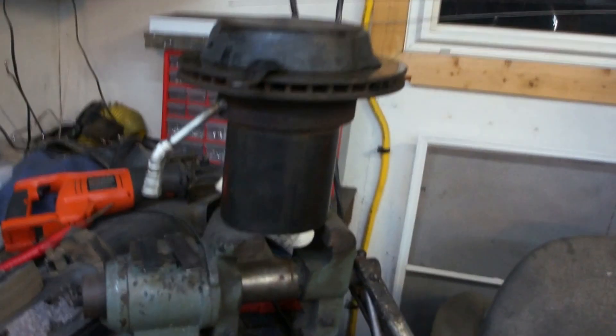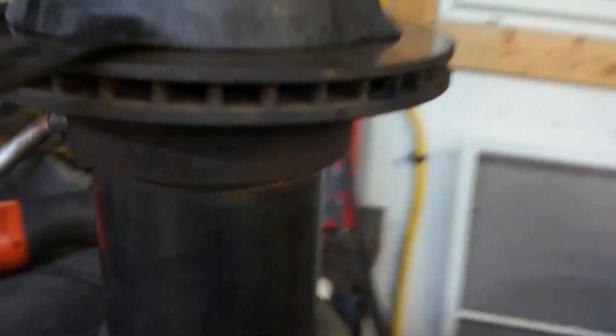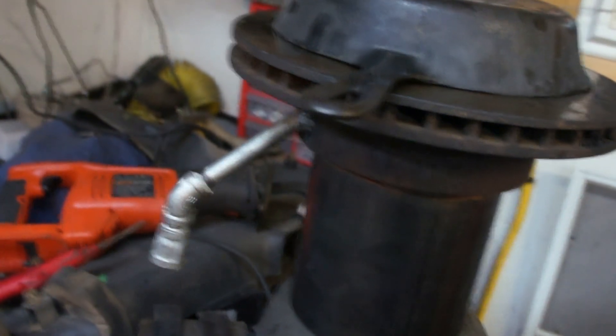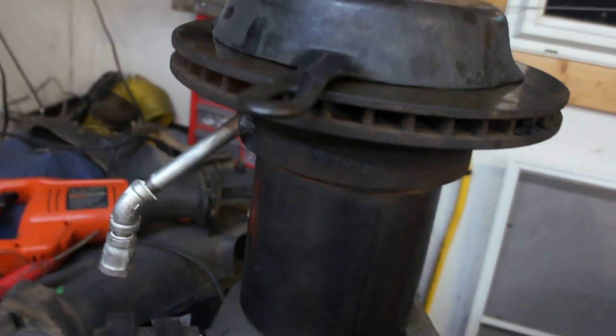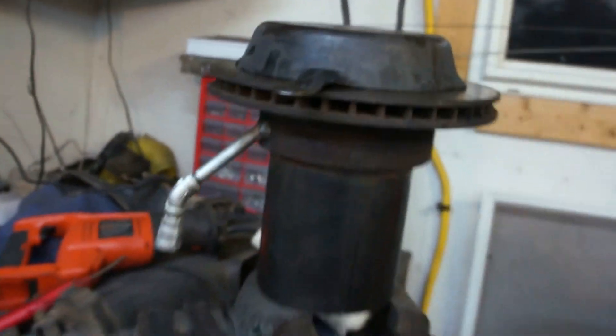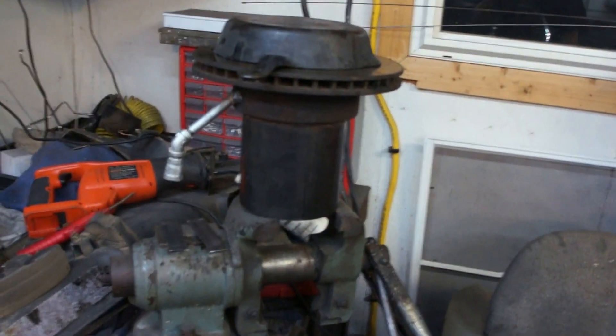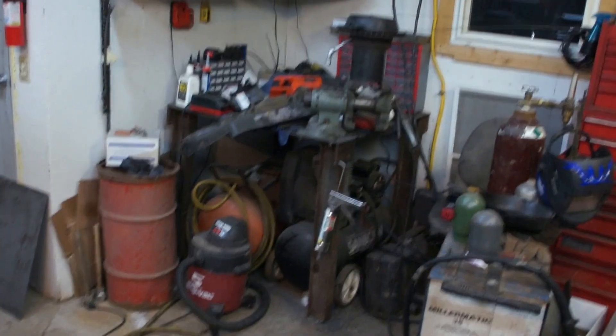I'd like to see how small of a unit a guy can make and how efficient in oil use. I think this may be too big — I need a smaller pan and maybe a smaller brake rotor, something off a car instead of a pickup truck. The smaller the burn chamber and pan, the easier it'll be to heat and get to optimum temperature to flash-boil the oil into a vapor for burning. I think reducing the size on everything will get it under that one quart per hour that everybody on YouTube is at. I'll end this one here and we'll pick up later — see you later YouTube.